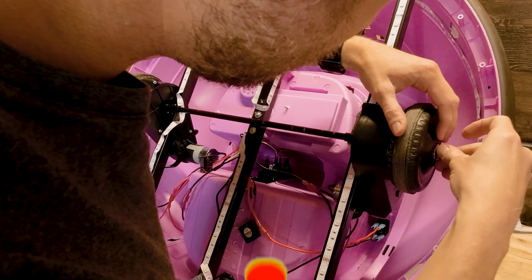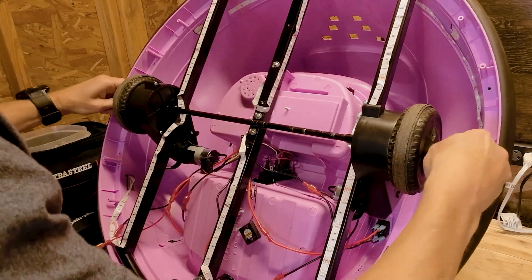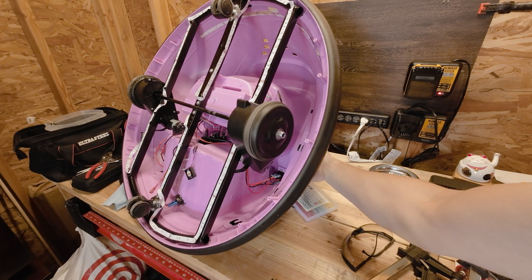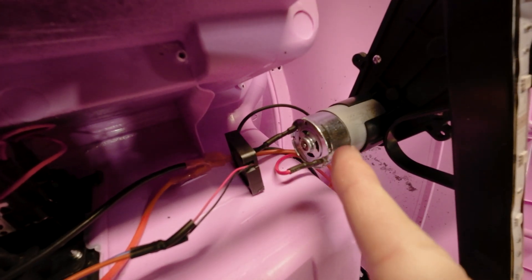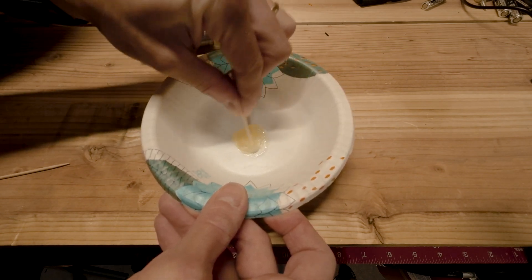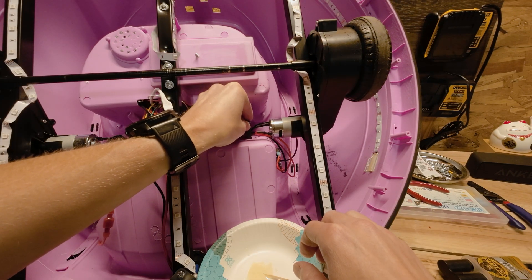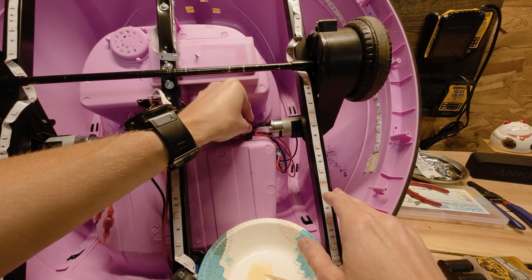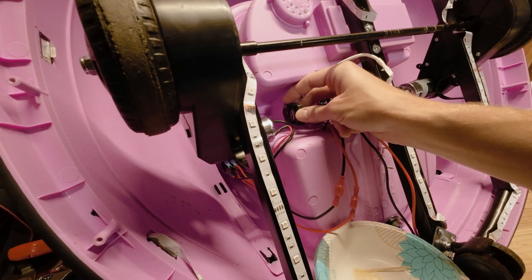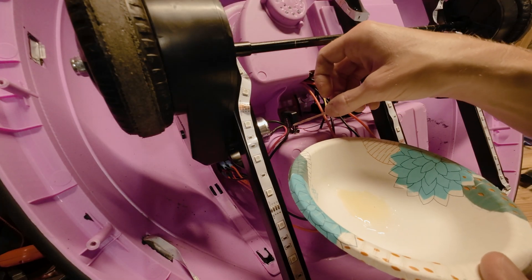If you've made it this far in the video, I'm glad you're enjoying it — please give a like and subscribe to support the channel. Quick op tests confirmed everything was good to go. The new motors sat in a different spot, so I had to relocate the cooling fans. To keep the fans in place I used Gorilla Glue epoxy, which has a strong enough hold even under all the movement and bumps during use. The new location allows the cooling fans to blow directly down the case of the motors — I figured this would offer much better cooling.